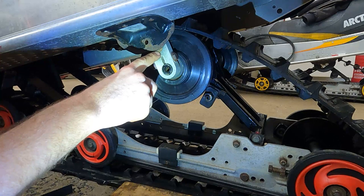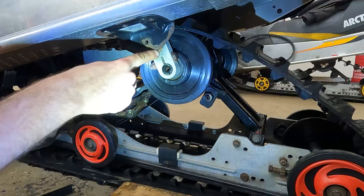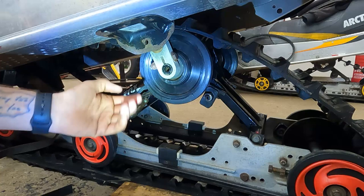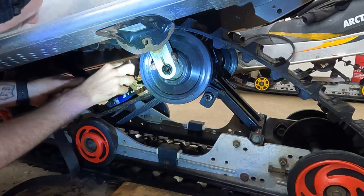I'm pretty close. The hole with the threads is up here and the hole I've got to get it through is here. I'm pretty close height-wise — I can't bring it down anymore or else I'll be below it. I'm going to tighten that ratchet strap to bring it forward, get lined up front and back first, and then use a pry bar with two-by-fours to get my height.